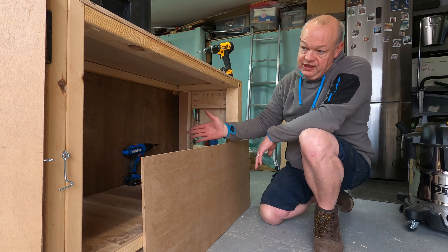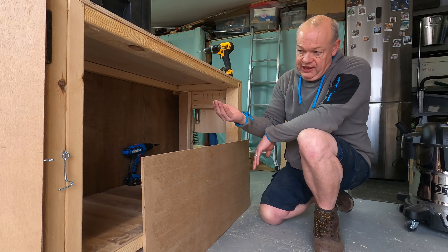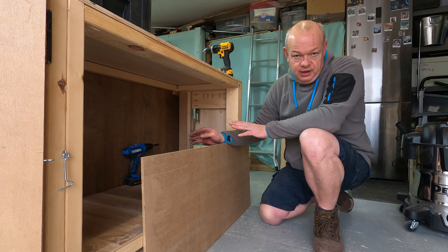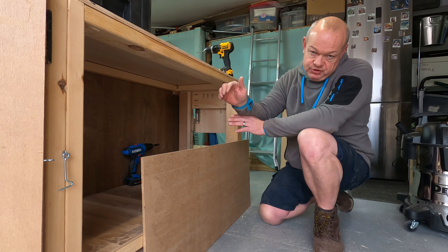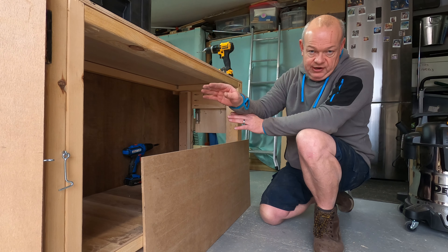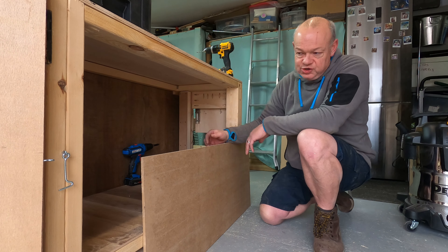The next thing is to design these rails — I'm going to make them fairly chunky. I want them to protrude quite a bit to give a little ledge for the drawer to rest on with some wiggle room. I'm going to cut all four of them and then use a spacer in between so that when I install them I can use the spacer — a little bit wider than the board — to make sure they line up properly. I've got some really nice quality external siding wood that's strong but quite lightweight, so let's go have a look in the wood pile.